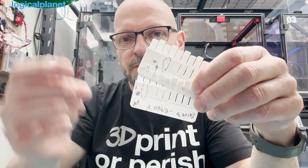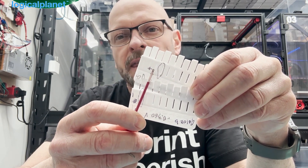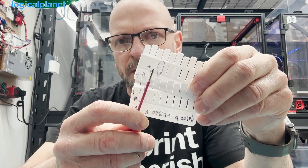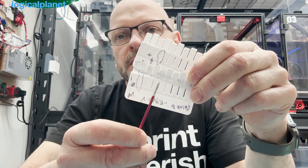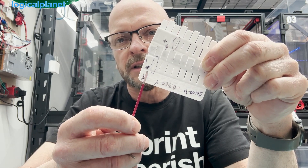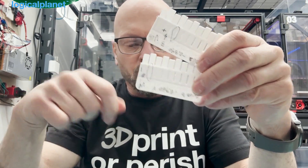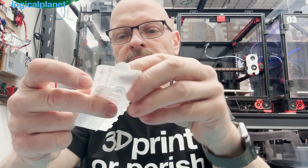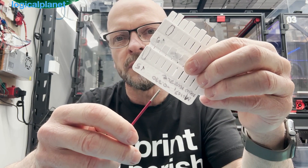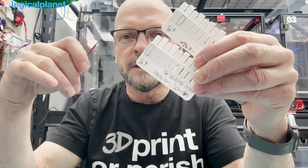In this example I had a 0.4 millimeter gap open, which means I was closed on the 0.3 millimeter slot — effectively about 0.15 millimeters of flare. I shifted that over to the 0.2 millimeter hole being open and the 0.1 being closed by raising my z offset by 0.02 millimeters, and I thought that was fantastic. Then I moved it even tighter — from the 0.2 millimeter to the 0.1 — again requiring a 0.02 millimeter increase in z offset.